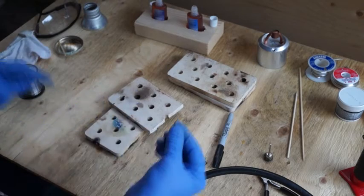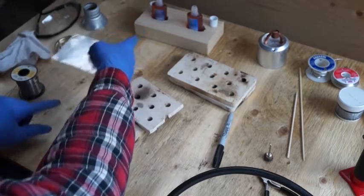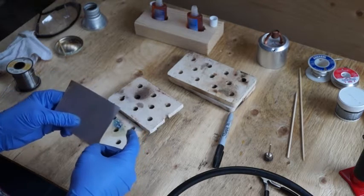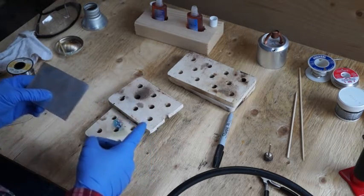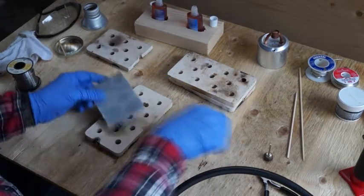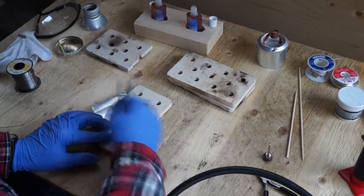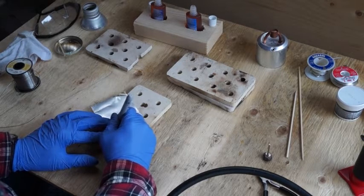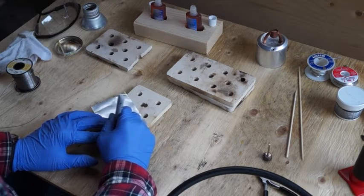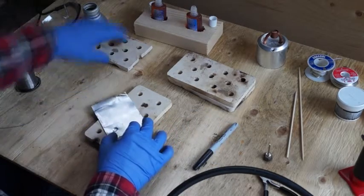I'm going to show you that it does work. I'm using the 180 degree flux because when that one runs out I'll use the next one. It seems to do the job a little quicker because the flux reaches proper temperature quicker, at a lower temperature. The one disadvantage I've found is that the flux gets really fluid just before it starts to burn, so if you want your puddle to remain in a location, you almost have to solder flat.